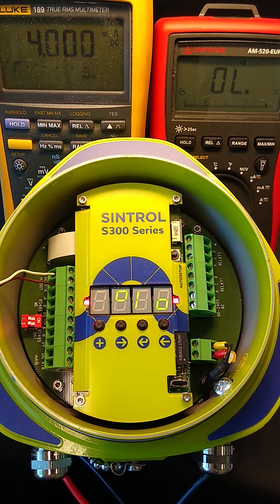Now we are waiting for the 16 milliamp to ramp up. You can see it goes up to 16.8, 16.9 milliamp. It is referencing on the span level. That will also take a while. Now you can see 80% and the zero and span check is finalized.